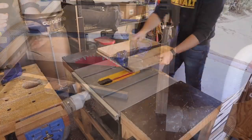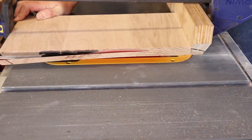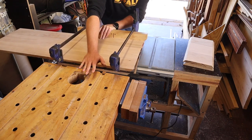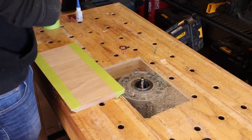I'm going to use a monster chamfer bit in the router table for perfect 45 degree mitres at the corners, but to make it marginally safer and easier on the bit, I trim off some of the excess using my bevel sled. With hindsight, I probably could have taken a bit more off, but I played it safe.